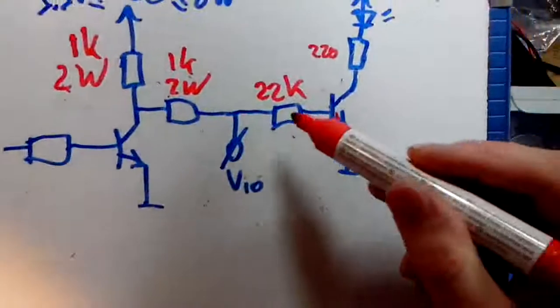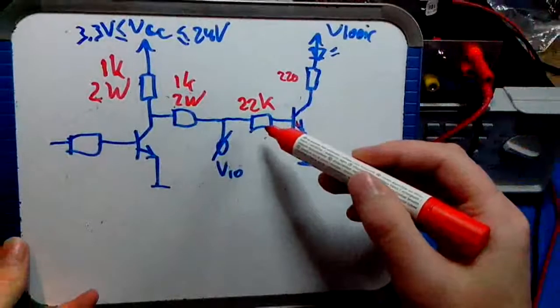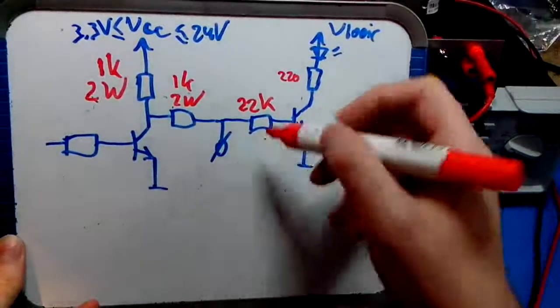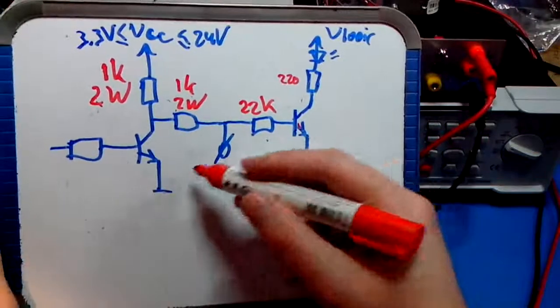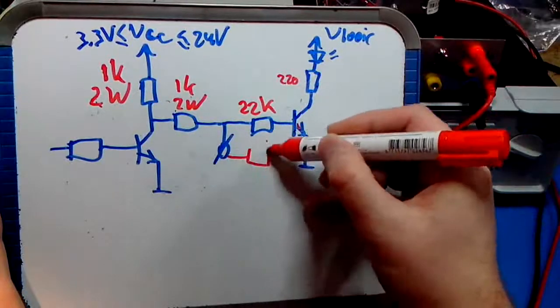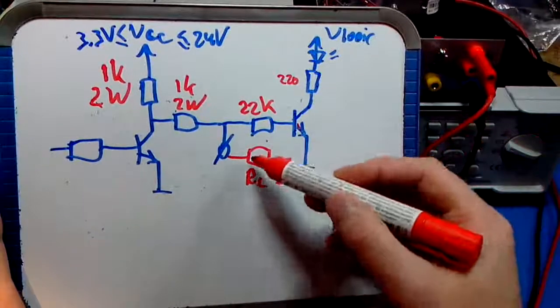Now, as we saw, there's this input resistor. Let's take a look at what happens if you use this I/O pin to drive your circuit. So you use the box to drive your circuit. You connect your circuit as an output of this I/O pin, which means basically that you're connecting a resistor, let's call it R load, at the output pin.